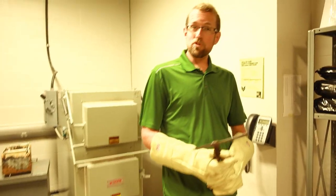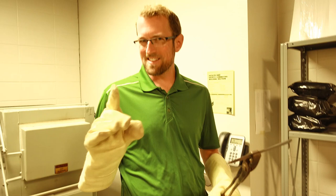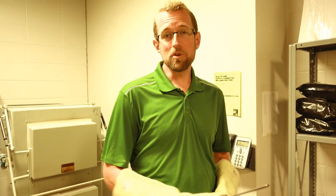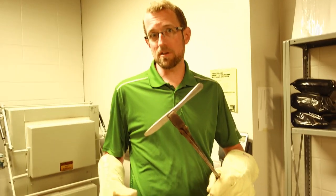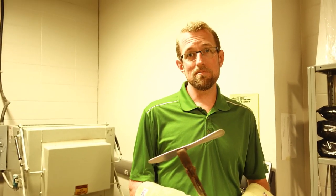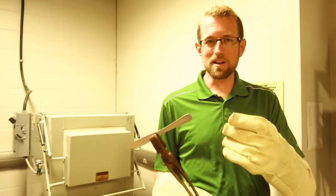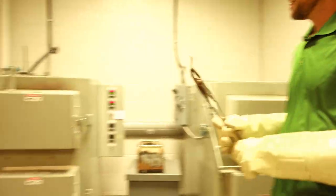The exact temperature that we would put our steel in depends on the carbon content of the steel, but all regular, normal, non-stainless steels would go through the necessary phase change at 910 degrees Celsius. So regardless of the carbon content, it's definitely getting hot enough here in order to cause that change to happen. And once we quench it, turn it into that really, really hard structure. Or maybe not, because stainless steel is different, but let's take a look.